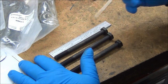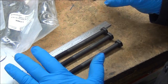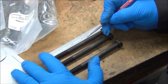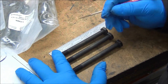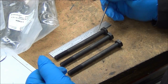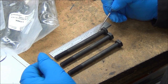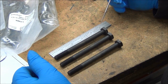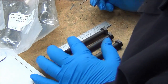I also want to practice so I can start getting them the same length. I don't have a depth stop made for that one, so I think what I'll have to do is put a little witness mark and set it into the chuck at that depth. Then I'll cut these off at a certain distance, figure out my part zero, have them face down, and have the profiles cut.